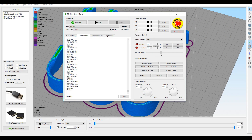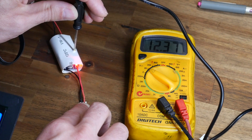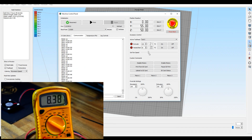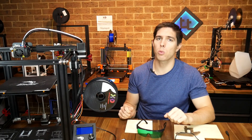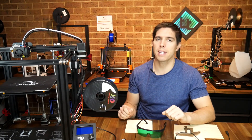For the initial calibration you need to be connected to software that gives you control over the part cooling fan. Start by turning it the whole way up. You can now use a multimeter on the buck converter and turn the adjustment screw until you get it to around 12 and a half volts. This gives a usable range from around eight or nine volts all the way up to the full 12 and a half volts when the fan is turned on the whole way. That had far more steps than I intended, but all of the hard work is now done and the next step is a little bit of calibration and setup on the printer.